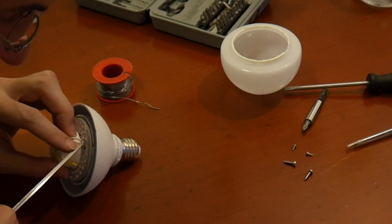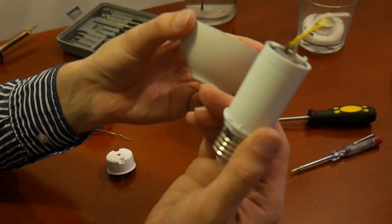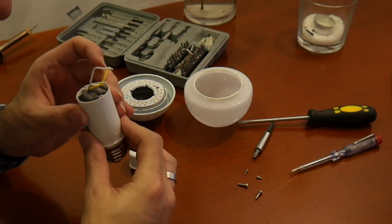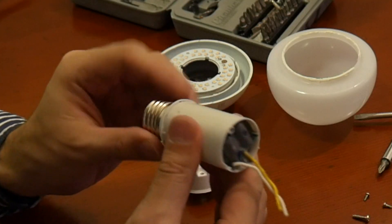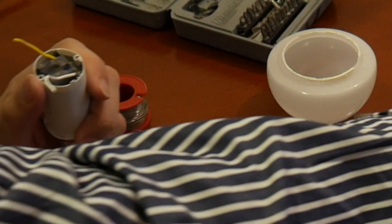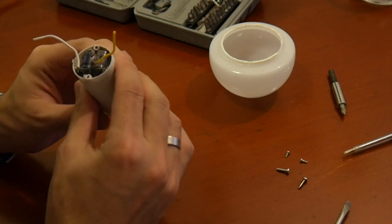It's not likely we're going to fix this anyway. Now this is coming off. This is how these pieces look, just inside there. I'm pretty sure this glued piece of PCB is probably defective. It's a little bit sad that you have these LEDs — the LEDs are not getting defective, but this stupid, completely glued constant current source is. There's no way except Dremeling this off to get in there, and even if we could, it's no fun to repair this glued-together thing.